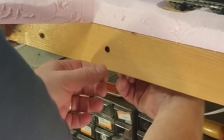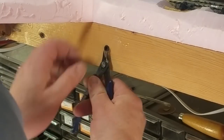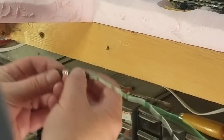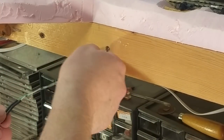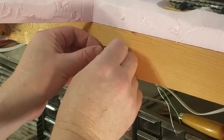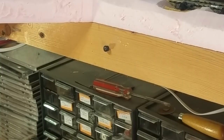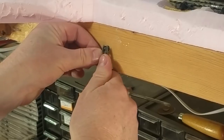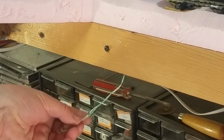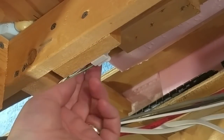I need to put the LED in the bezel before I put it in the hole, because the bezel locks onto the LED. So that's in there. I squeeze and press-fit the bezel into the hole — it doesn't go as easily with the LED in it, but it grips on there and looks like a little indicator light. Now I just have to go under and hook these up to the little terminal block I screwed in there.